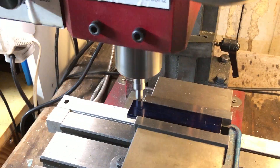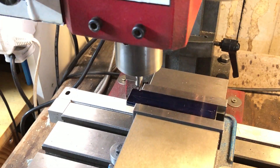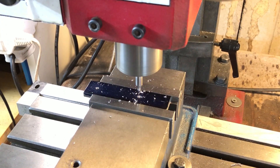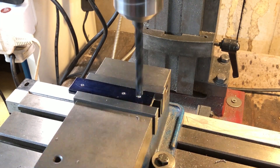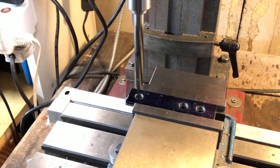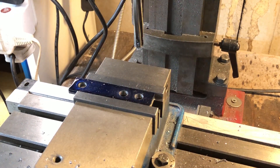I'm edgefinding and moving to centre using the half feature on the DRO, and picking up the first hole location by eye. I'm then zeroing the DRO and dialling in the end location of the slot, and the centre of what will become the threaded hole. These are then drilled to 19/64ths, and all reamed to 5/16ths to provide reference holes for locating on the rotary table, and also later on on the lathe.